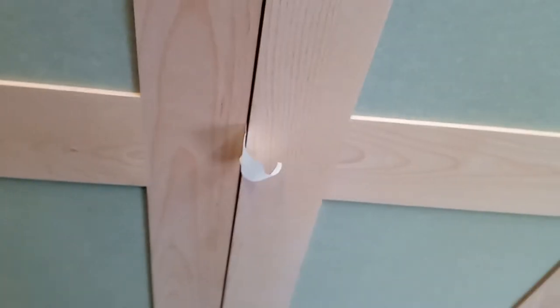All the doors are on — they fitted alright, just need to trim them a little bit. It's all a bit of a house of cards with nothing being glued together yet, these move around a little bit. There's a little gap down there but that should pull up. It's pretty much square at the top — I've had to put this brace on just to push it over a little bit. The brace is pushing it forward a little bit. See the bottoms don't quite go together, but if I push it back at the top there, they're closed. When I get to site I can fix it all in place and push it, pull it, put screws in.